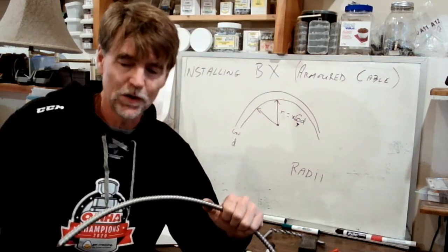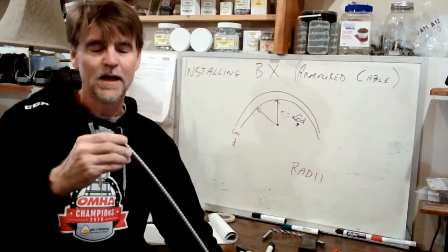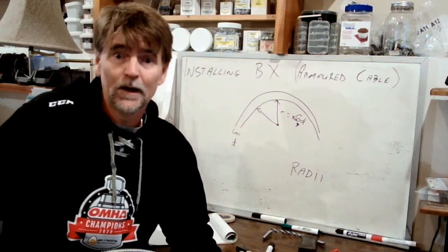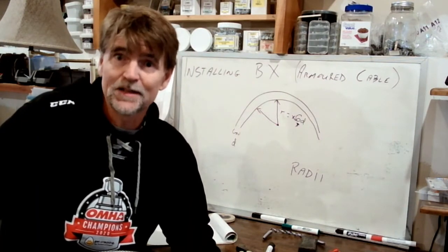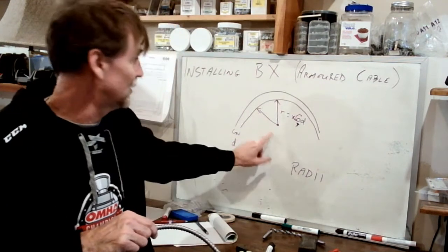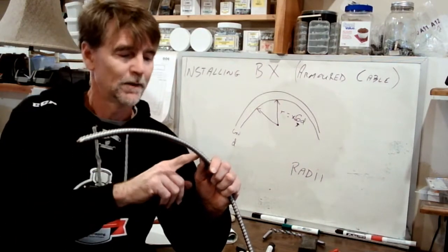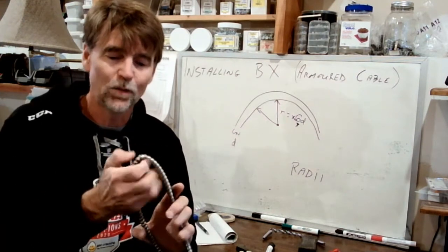And so I will show you the incorrect way. Depending on the job sites that you end up on, understand that many people may allow you to do this, but certain people may absolutely prohibit this particular procedure. So I'm going to go back to the whole radii of bends conversation, and I'm going to intentionally kink the wire. So let's pick a point, and I feel I need about this much tail, so I'm going to go here and kink the wire.